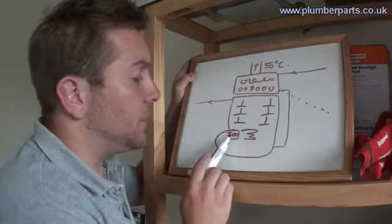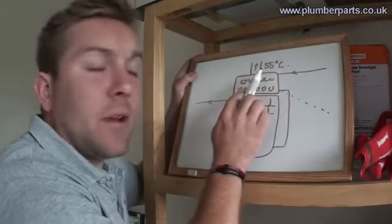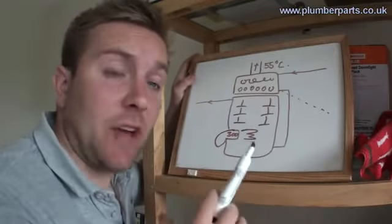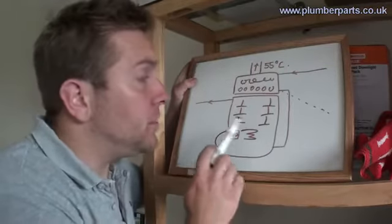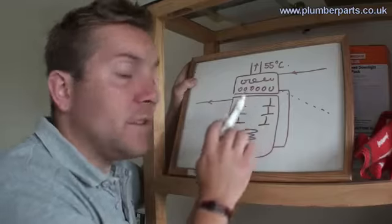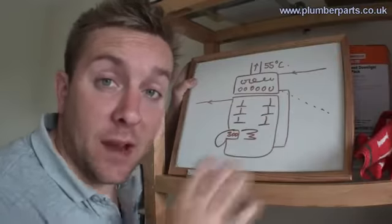So that shows there you have the same heat input at the bottom as a conventional boiler, but you save all this energy because so much extra heat is being extracted and put into the water that goes off to your radiators. Remember, there are two much more efficient heat exchangers here, even when the boiler is not condensing, because sometimes when the return temperature is warm it won't condense. It will always be a lot more efficient.